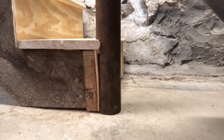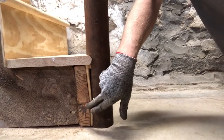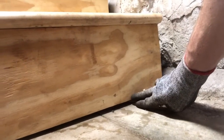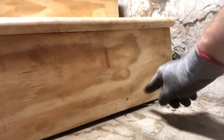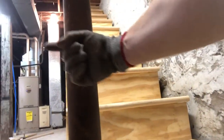I'm trying to figure out how to attach this so that it is strong - so that when kids are swinging on it, it will not move. The way I've decided to do it is: this newel post is going to be anchored to a 2x7 and a half inch board - used to be a 2x10. On the other side it will be anchored against the concrete using tapcon screws and an angle bracket. I need to make the fastening between the newel post and the 2x7 strong enough to take care of lateral force. The force up and down the stairs will be handled by the handrail, so it's just that side-to-side force I'm worried about.